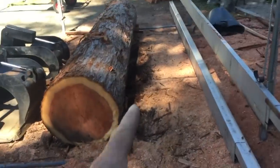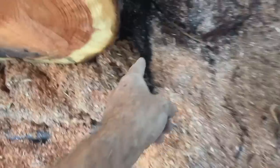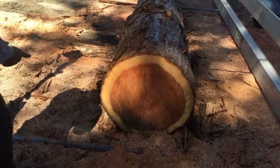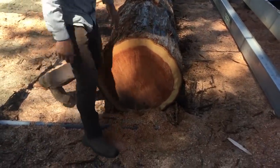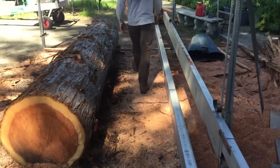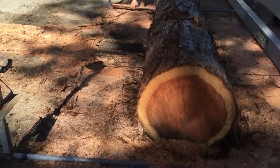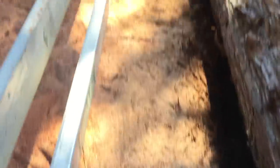With the Bobcat, I wedged the backside of the log so it would not move, and I moved it over just a bit. I put an approximation mark on the ground where I thought it should be — I think it's got to come about two more inches. When you're milling, ideally you want the log as stable as possible. You can cut wedges and shove them in — that's the best way to do it, because you don't want this thing moving while you're milling. The parallel between the rails is just a little bit more on this side than that side. Also, when you have to put risers underneath to bring one end up, try to avoid having stuff sticking out where you're going to trip — try to keep your walk zone clear.